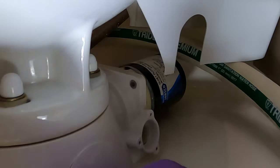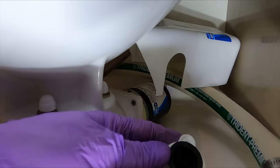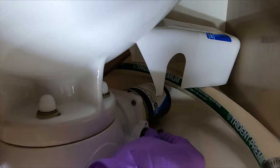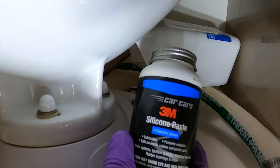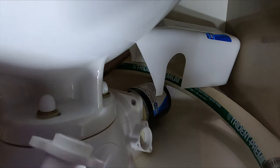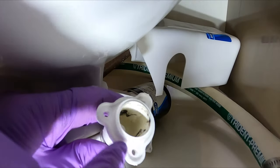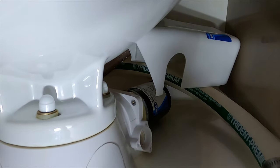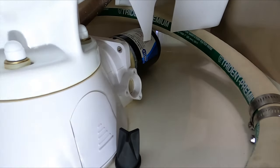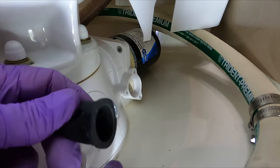I'm a little grossed out by this, but I have high hopes. I'm pretty certain the joker valve goes in there because it's a one-way valve — it's got to go out through there. You don't want to put it in backwards. I don't think you could put it in backwards anyway. I'm going to throw a little silicone paste on here as well, just to make sure we get a good seal on everything. This must be the gasket that seals it. What seals this surface is the joker valve itself. Let's throw a little silicone paste love on the back and the front of the joker valve so we get a good seal.